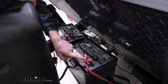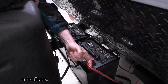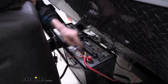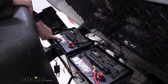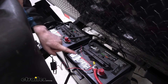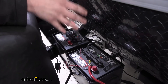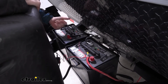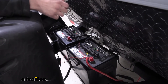If we take a look at these two batteries here, we've got a positive and a negative, typically labeled with red for positive and black for negative. The red positive cable goes from our trailer to the junction box — that's our power out. Then the ground wire on this battery is going over to the positive on our other battery, and what that's doing is hooking these two batteries in series, which adds the voltages together. So with a 6-volt and a 6-volt wired in series, that gives us a total of 12 volts — essentially making a giant 12-volt battery. The benefit of doing this is that 6-volt batteries often have a larger capacity than 12-volt batteries, so you're going to have more runtime for your accessories inside.